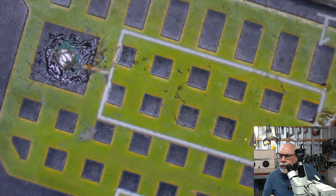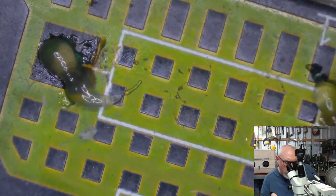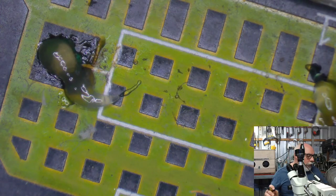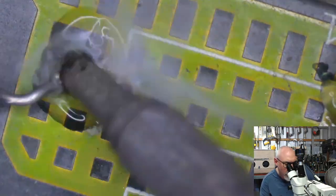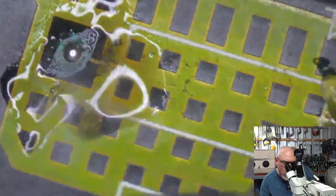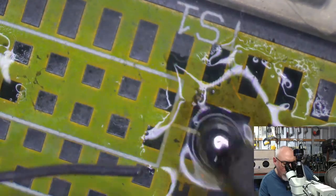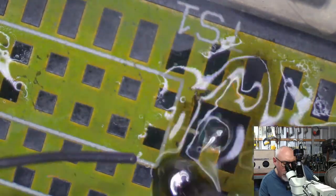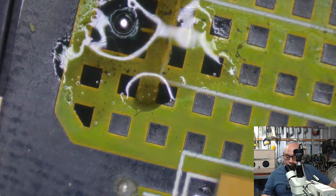If the CRT wobbles on a Plus, is that cold solder joints or analog board caps? I would always check the solder first, always, because that is the most likely problem they have. It can be other things. It can be flyback. It can be deflection transistor. It can be caps. There are lots of things it can be. But I would always start with the solder joints, because every single Mac Plus I have ever had brought to me has had cracked solder joints. Bad ones. So that's where you start.